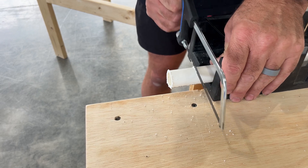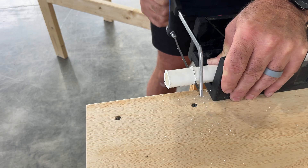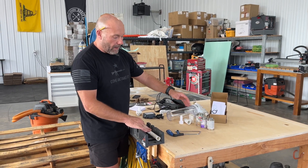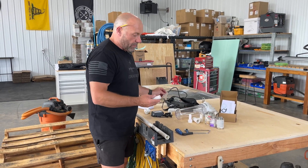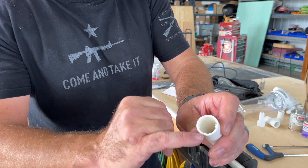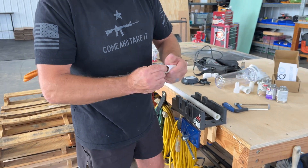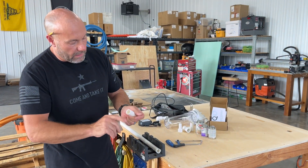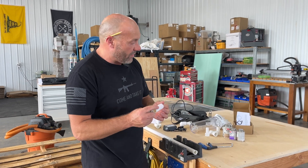Something that is handy here is just a miter box. I have this set up on my vice — you can just set the pipe in there and it'll give you a straighter cut for the lengths you want. But you can use just a simple hand saw or hacksaw to cut these pieces to length. Once you've got the measurements down, mark them, and then once you're done cutting, take a small piece of sandpaper and clean up the edges. You don't want any small burrs showing up because that'll affect the seal. Clean up the outside, clean up the inside, and make sure you brush all that off.